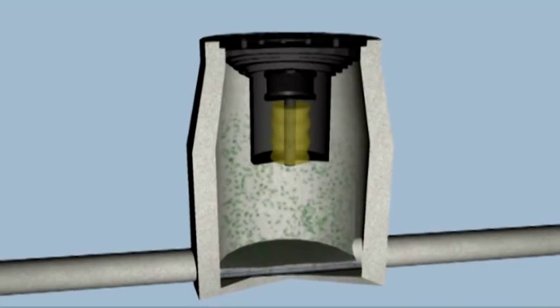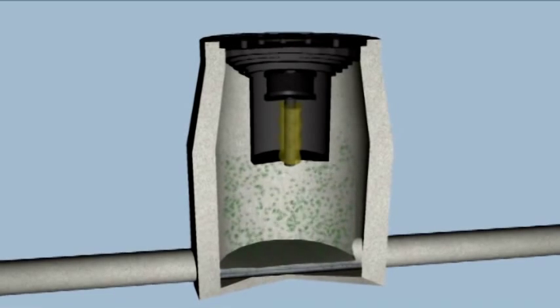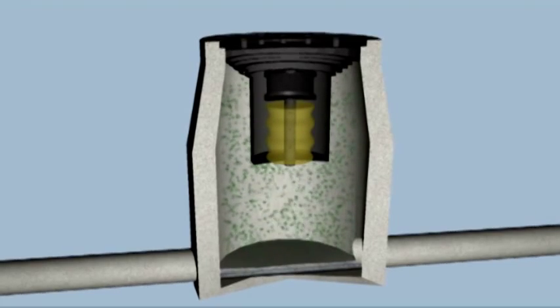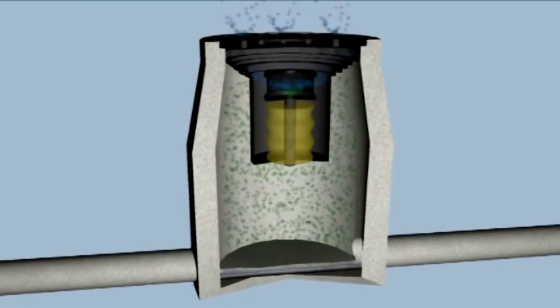In this first animation, you can see the gases arising from the sewer. The gases sometimes rise and fall. On small fluctuations, the gas inflates the bladder and then deflates. But all of a sudden, you get a spike. And when that spike hits, the bladder inflates, opening the small pressure relief valve and the sewer gases exit through the carbon filter to the atmosphere.